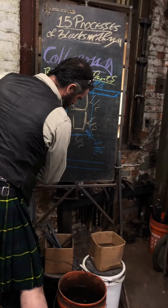And that hopefully will give us two legs that have both been progressed equally by 1/8 of an inch, so that they're staying at about the same length. All being well. Also be careful as you fold not to get overexcited and beat it to death and actually narrow the thickness of your material, and elongate your collar as well, because that's another thing you can do.